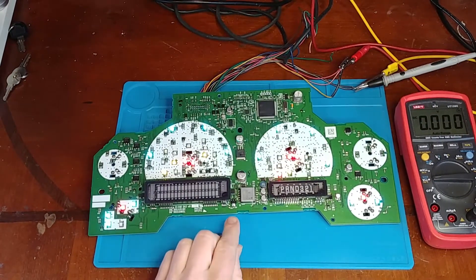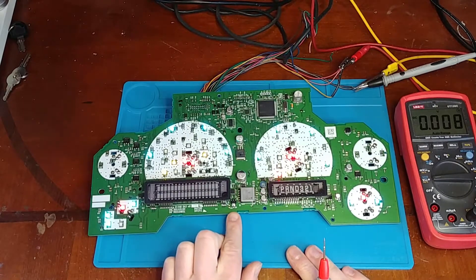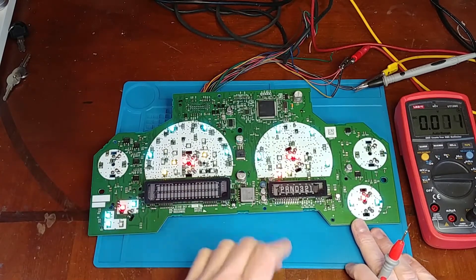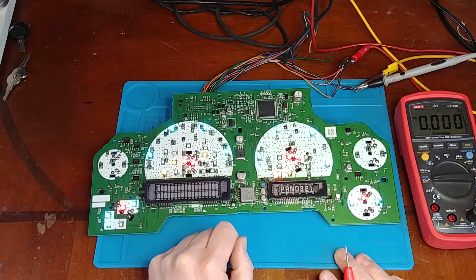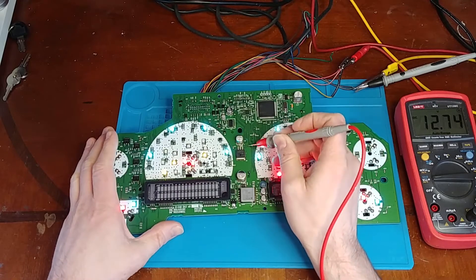I went through the normal MOSFET area, but that wasn't the problem. This is a 2008 board revision, not a 2007, so it's slightly different than the normal ones that like to blow up MOSFETs. But after a little bit of troubleshooting, I believe I narrowed it down to the voltage regulator.